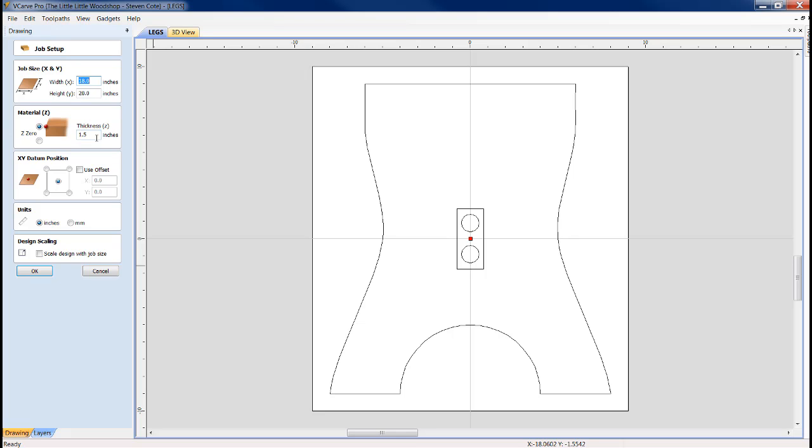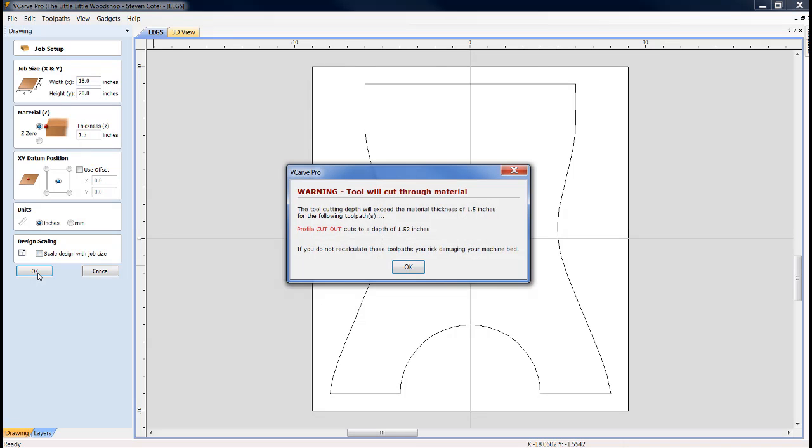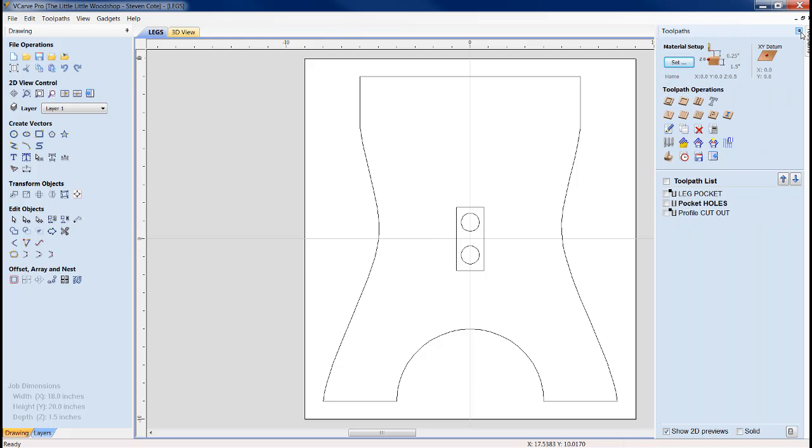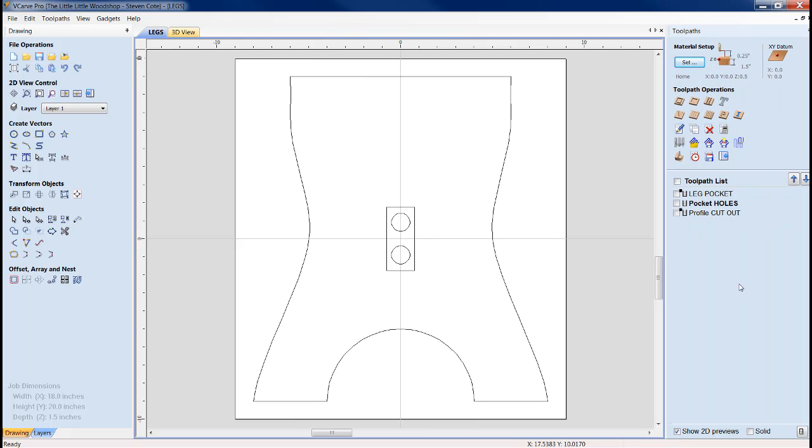Same thing again, 1.5-inch material with your datum in the center. Units of measurement are inches here. Alrighty. Now we're going to bring up the tool path. Same thing again. Insert your piece of material against your fence and your stop block, face side up. If you don't have a device big enough to plane this, you're going to need to use your spoiler board bit affixed to the spoiler board on your CNC router table.